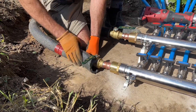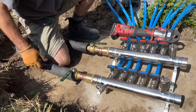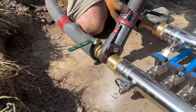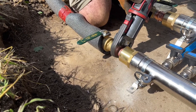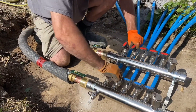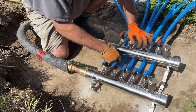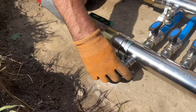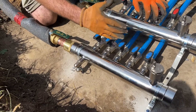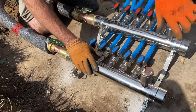I have to check to make sure that the ring is not in distress. What are those? These are the drains, and these are air vents — if it's horizontal. If it's mounted vertical, then this air vent goes here and the drain goes here, so you can drain and make sure that all the air is vented from it.